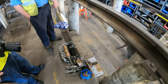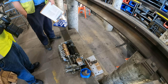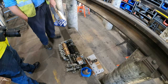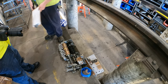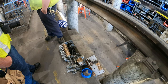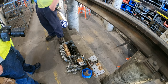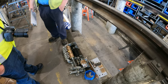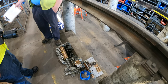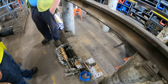And this is mounted under the car. This is a derivative of the Westinghouse equipment. GE controller looks a little bit different. Historically, it was mounted just forward of the MG intake, and there are pedal rods that run through a trough to the pedal compartment. On the X-Philly cars, they moved it up front and got rid of the pedal rods, so there's less stuff to maintain.